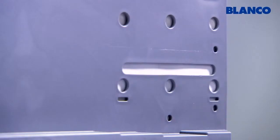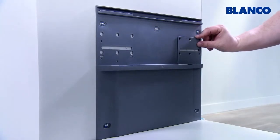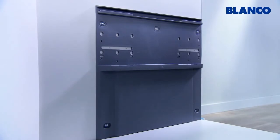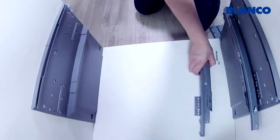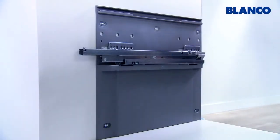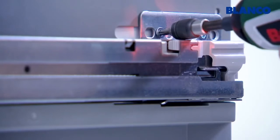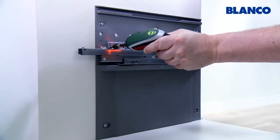With a wall thickness of 16 millimeters the side panel leveler is inserted in the side panel. If the wall thickness is 19 millimeters there is no need to use it. Put the extension track on the surface of the side panel and push it back — the track will lock in the steps. Secure the extension track with four countersunk screws; you can choose the positions for the screw holes.